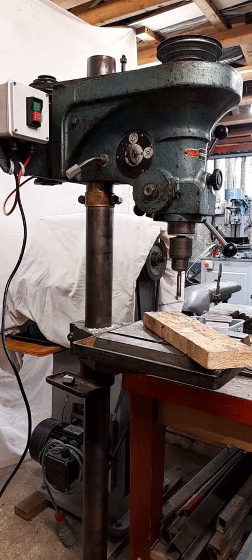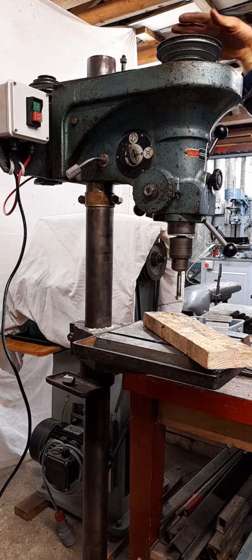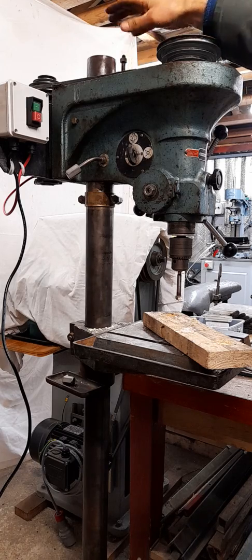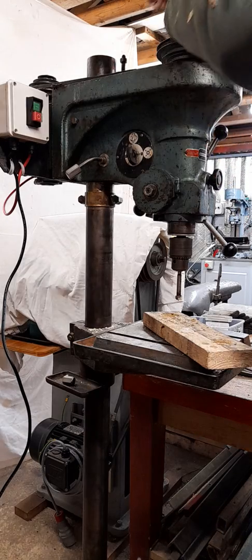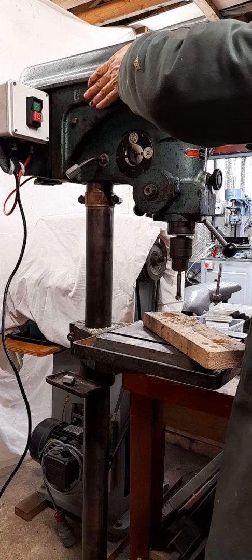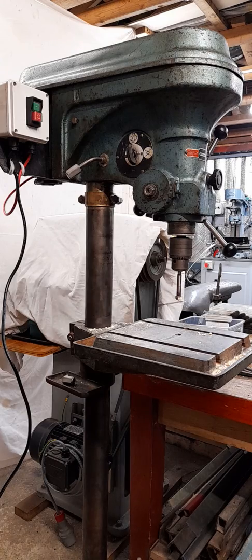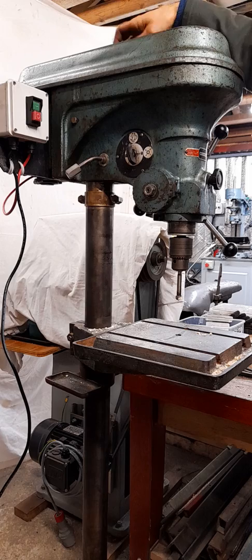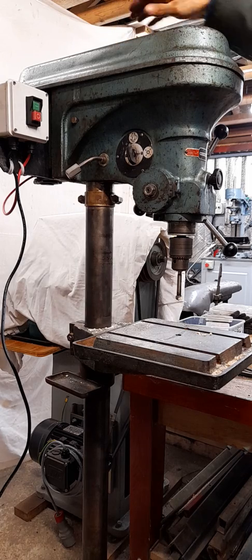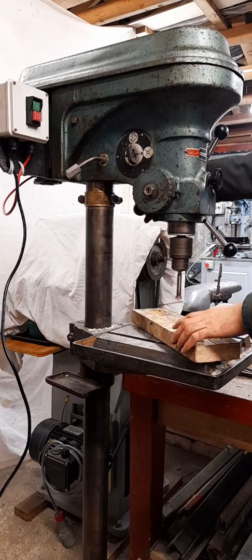The motor is a single-phase induction motor on a resilient mount, which is a little bit of a shame. Resilient mount motors are actually really popular with lathe users because of the reduced vibration, but I don't think reduced vibration is really too much of an issue on a drilling machine. Any old motor is going to do on a drill, that's what I'm saying. Okay, so we're going to go for a higher speed — goggles up, much faster this time.